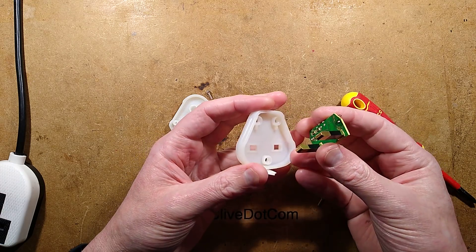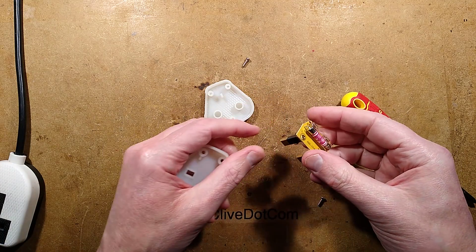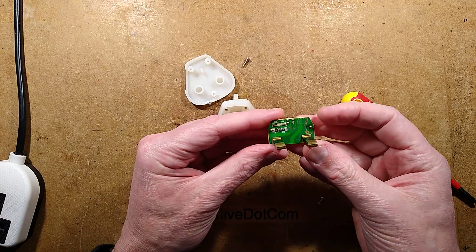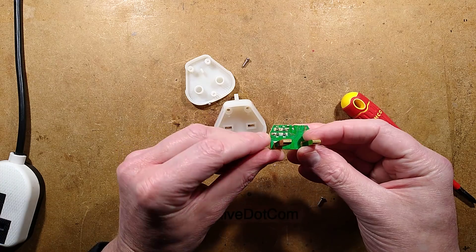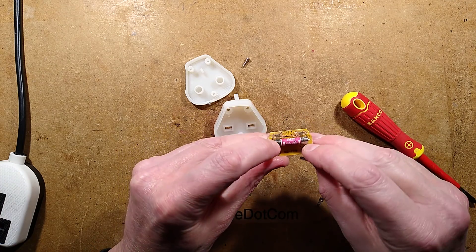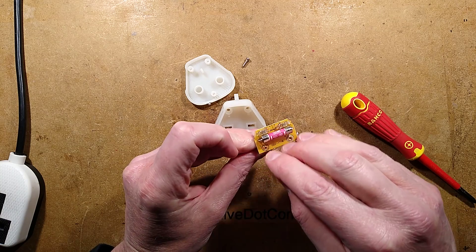Same arrangement where the pins can slide out, held in by this. These pins in the back of the plug top — inside it's covered in flux. Inside they've got a stack of resistors, and the two little neons are snugged right up against the fuse, which is why it was blocking the light.